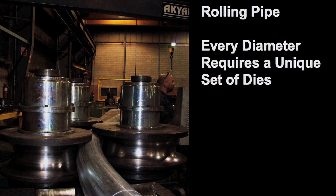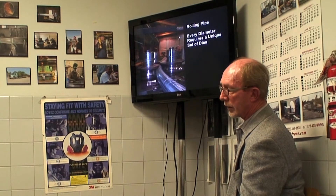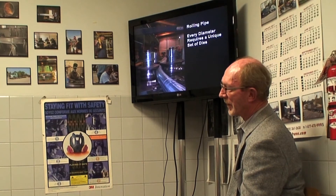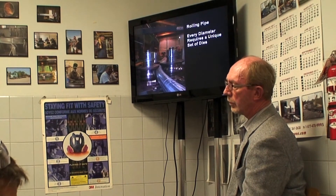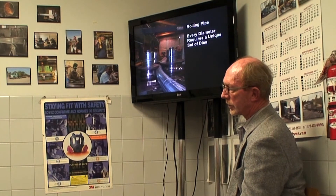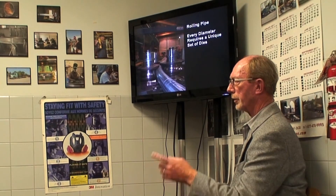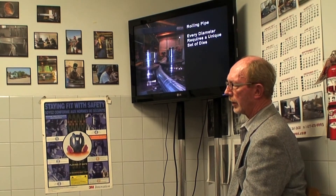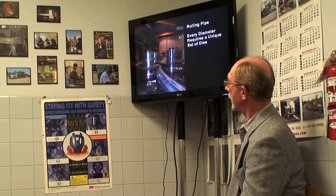Here we've got a picture rolling pipe. Every different diameter of pipe requires a complete individual set of dies, so at $100,000 a piece, we would like them to make fewer pipe sizes than we currently need. Because there are times people will come to you and say they need a six and five-eighths on a six-inch set of dies — it just won't work. What ends up happening is it'll elongate the material to fit the shape of the roll, and unless that's what somebody wants — which occasionally for architectural purposes they do — it's not a good idea on a day-to-day basis.